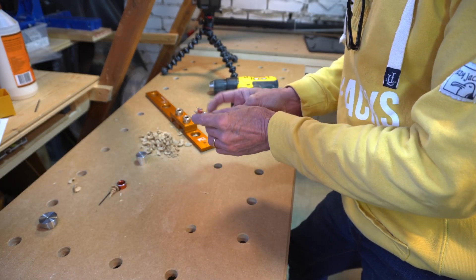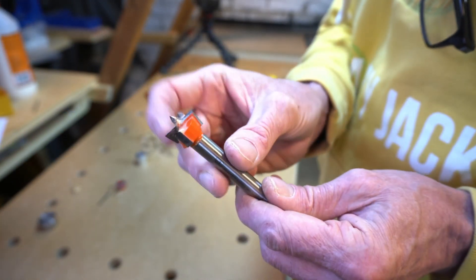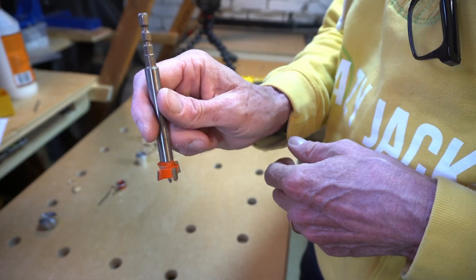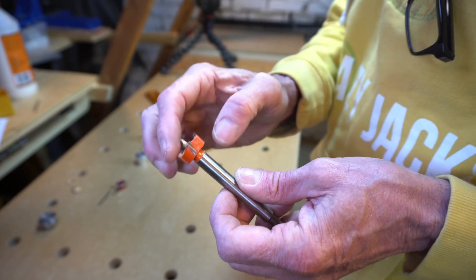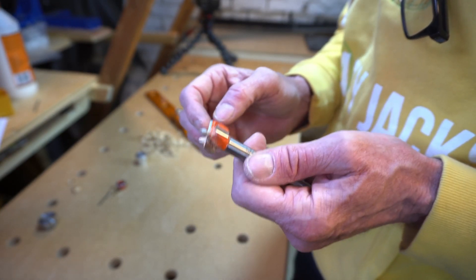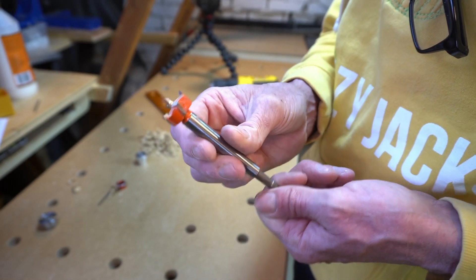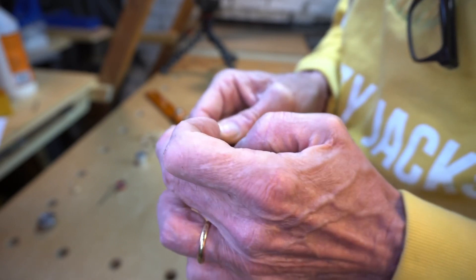The other thing to mention is that this drill bit is tapered — the 20mm is exactly to the sharp points on the end. If you drilled a hole and broke one of these points off, you would no longer be able to drill a hole large enough to accept the dog. You can buy replacement drill bits, but they're about £45, so you need to be quite careful with these little tips.